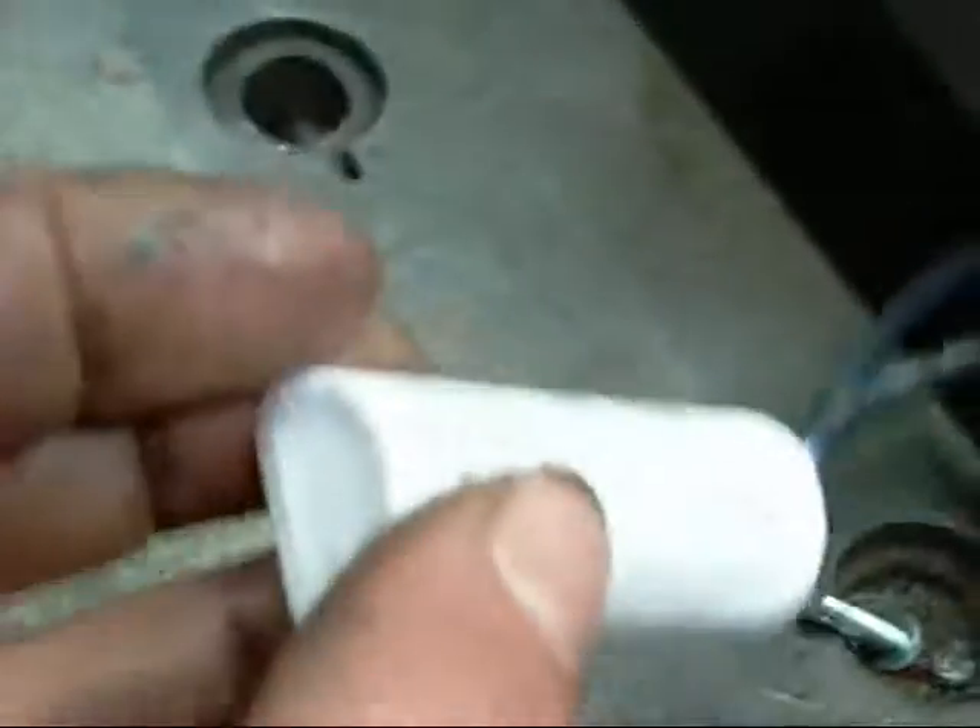It hasn't rubbed through but it's probably pretty close. It would have been oil leaking out past the crankcase heater if that was the case, but that's dry. There's a little flex in the bottom there. They're really flat flakes, so it's not just from a single impact from being dropped — it's an ongoing problem. There's a mark down here which corresponds to the location of that little heater point. The initial start up must force the compressor to kick and thrash around a bit, and it's broken the discharge tube eventually. Either that or it was going to perforate one day and let the gas and oil out — make a horrible mess.